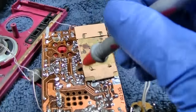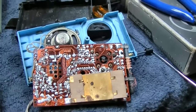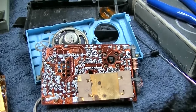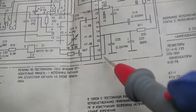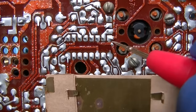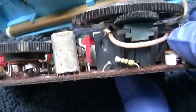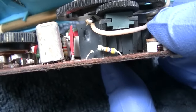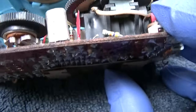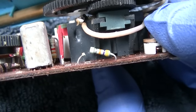The voltages are fairly close on this IC. They're not here at all. Maybe I should start by trying to see why the B plus is so low. Well, I started following this line back. 14 and 16 are tied together, and they come back to here, and I look up on top of here, and what do we have there? That's nice. That might make it not working. But what is that? That's a yellow purple orange.